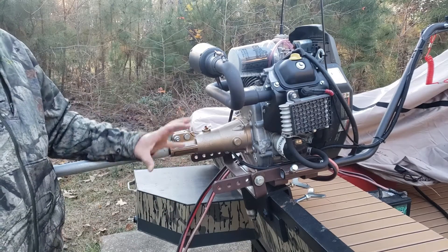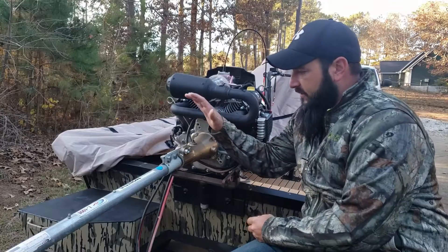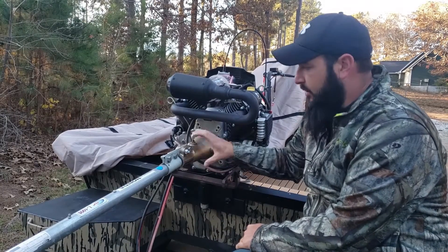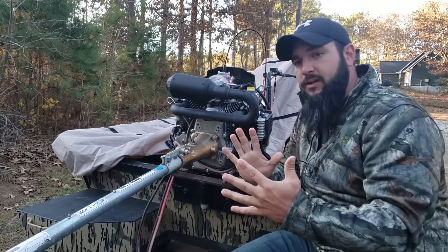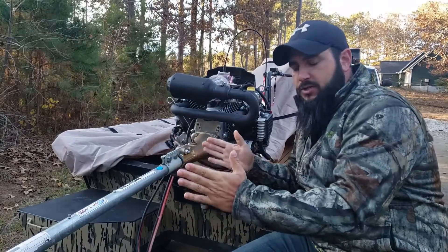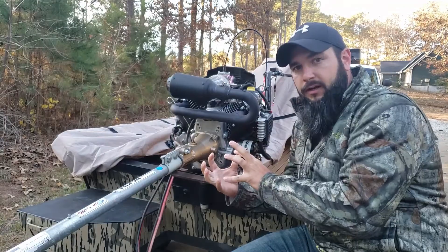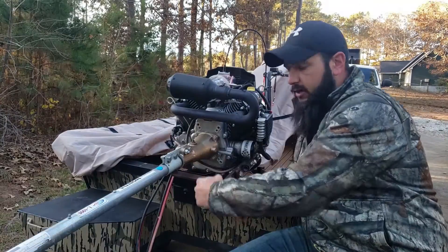Also, I'm thinking I can take this coupler right here and mount it to the bottom of the lower unit. On the lower unit where this part is going to mount, I can beef up the backside, drill and tap some holes so the coupler can go in there. Then I can take one of these long tail shafts, cut the outside down to the length I need so it'll slide up in there and still use this clamping mechanism, then figure out how much length on the inner shaft I need, cut it off, and drill and tap it for whatever size pulley I need. My other question is whether I need to put some type of pillow block or something in there to support the inner shaft once it goes through and into that lower unit.